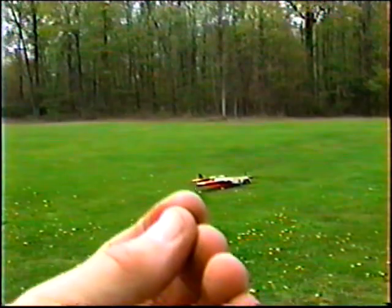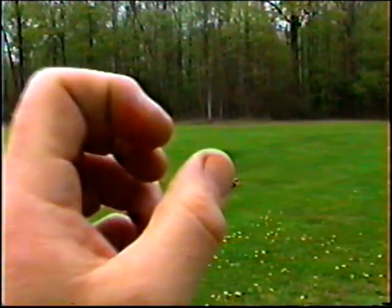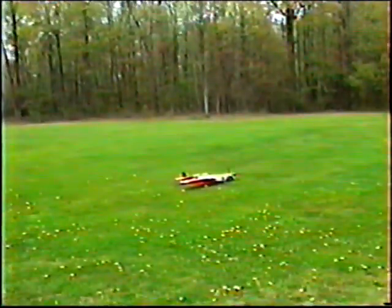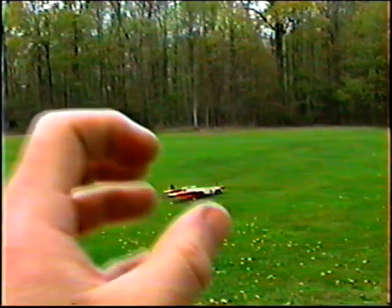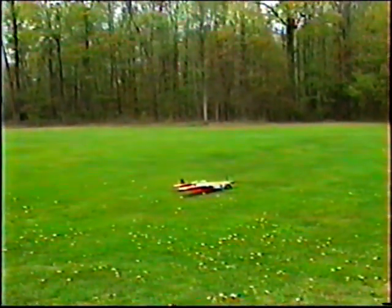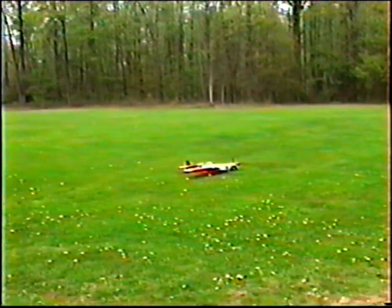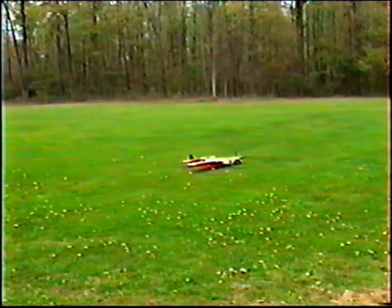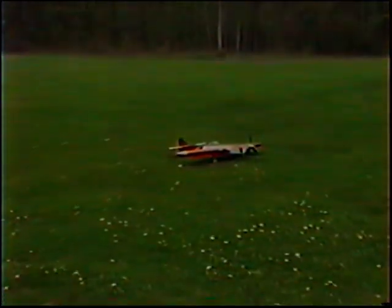Now what I surmise is happening is that because the blades are lighter, it's letting the motor unload in the 2-cycle, up top, overhead 8. So by lightening the blades, this is one example of where an undercambered job really helps. But now I want to move on. I want to try some of these other props. We're really using this day to good advantage. I'm surprised we're having this much really good luck. Getting a lot of good testing done today.